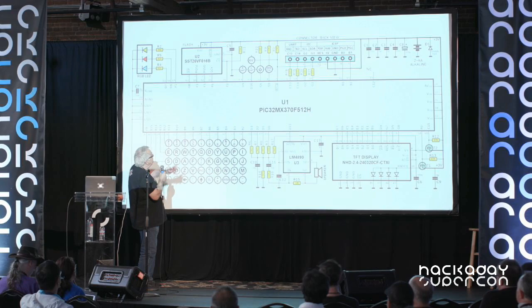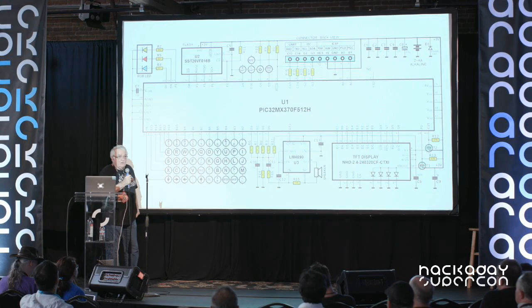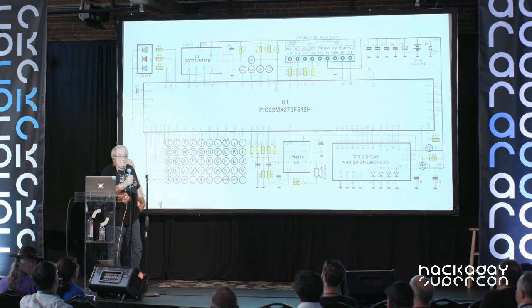The only thing I should note is you can see that the left shift and reset keys are connected serially. To reset the microcontroller, you have to first press left shift then reset. This is because there is a possibility that you could reset the microcontroller while you have some unsaved program inside. Just to be sure that you will not erase your program unintentionally, you have to press left shift and reset together. So maybe you tried to reset it with just a single reset key, but it simply does not work.